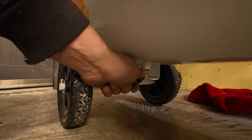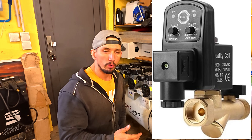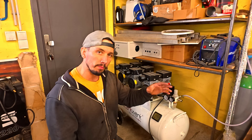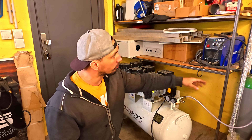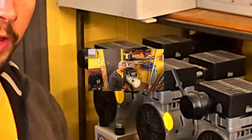So what we're going to do is install an automatic timer that blasts air out for a certain amount of time to make sure there's no water vapor buildup. And as it's sucking air through the system, water sits down here, it eventually comes up and gets into the lines and gets into the rest of your system. So how do we prevent that?